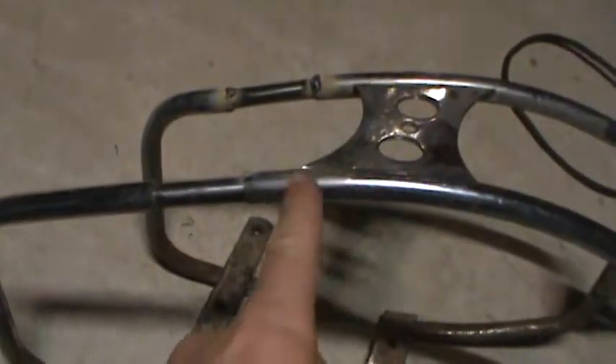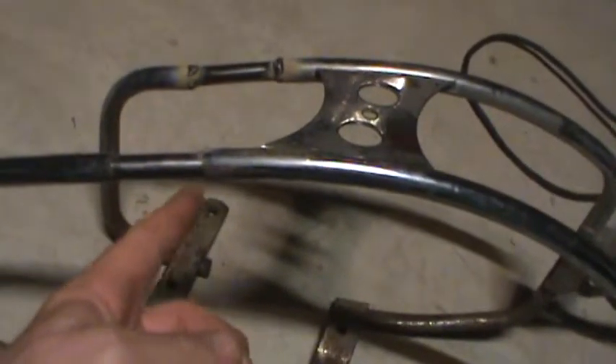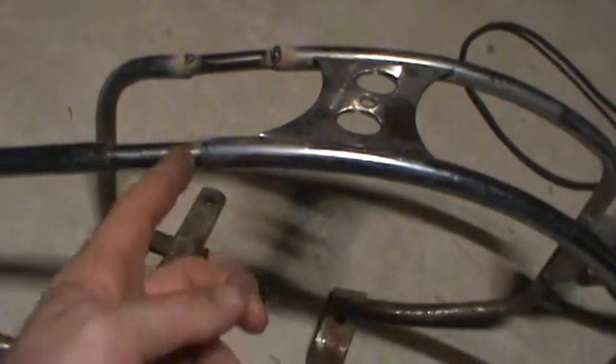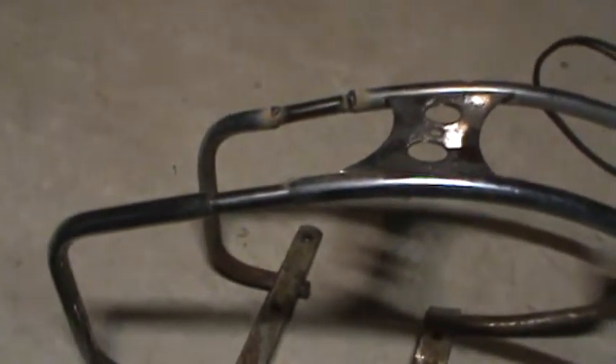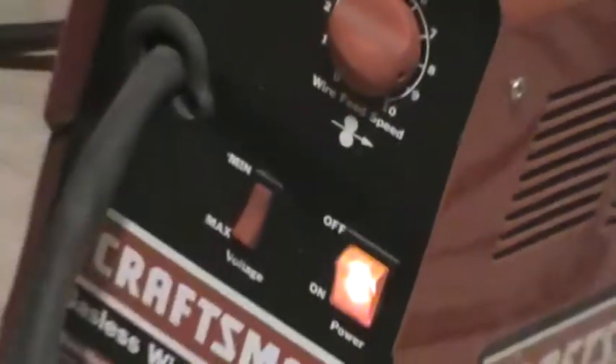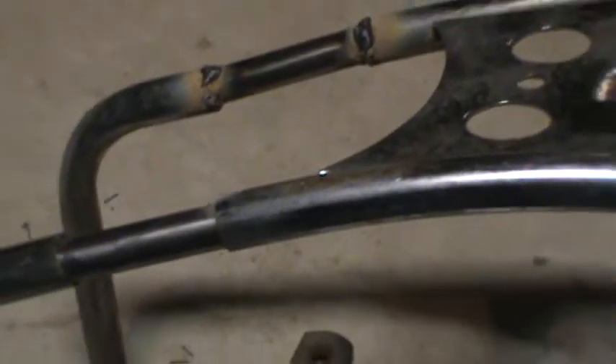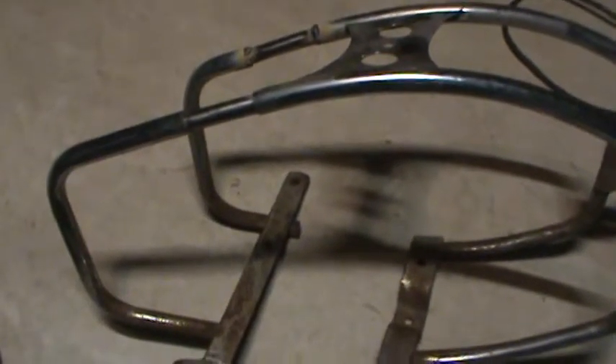My brackets that were cracked — the welds came out pretty good on those. Now this is chromed, so I couldn't weld straight through the chrome, so I just cleaned up the ends where it was rusty, and then this is just bare steel pipe. It gets good continuity on the ends where the chrome is cut off and on the steel pipe, so it's working pretty good. Got the welder, a little Hobart 110 MIG, flux core, set to minimum. This is about half inch diameter pipe. These had flexed out a little bit so I had to bend them back to get the proper distance so the bags wouldn't be rattling around.